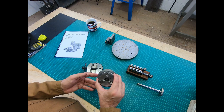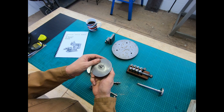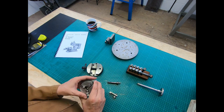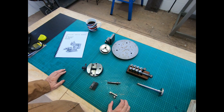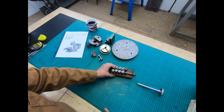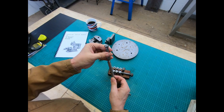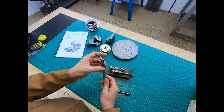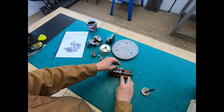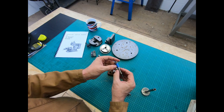That's quite interesting — I'm going to investigate whether I can easily make this removable, or maybe just make another plate to fit with a larger or Emco chuck. In line with my goal of making things reusable across different machines, that would be pretty good. There's also a set of collets and the drawbar. I've given them all a basic clean and tried them all in the machine — everything goes in fine except for the one-sixteenth, which I've marked with blue tape as it won't go up into the collet for some reason — something to investigate.